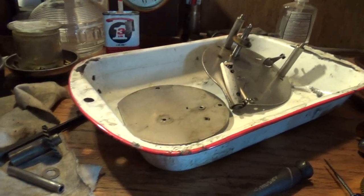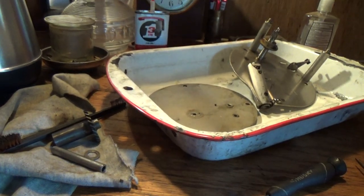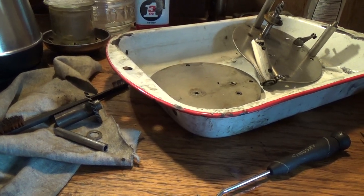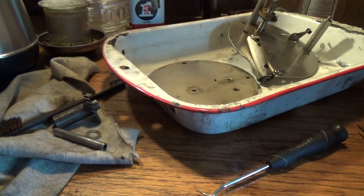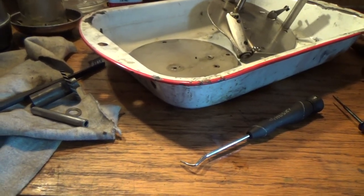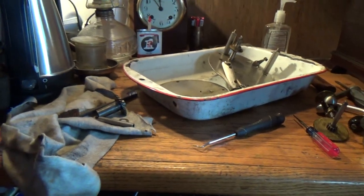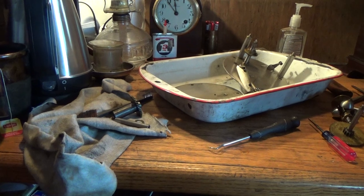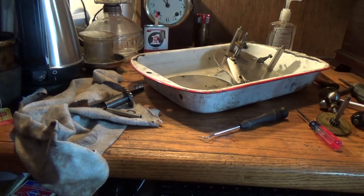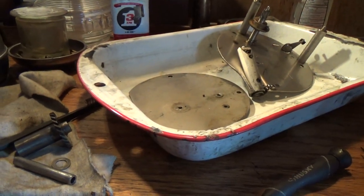I am working on a 410 motor again, from another HMV 101. This machine was one that I bought from another collector some years ago. The collector had somebody install a new mainspring in it — common enough; I generally do this myself. Whoever did it did put the mainspring in, and it appears to be functional. They actually used the old-fashioned formula, which is black graphite with Vaseline by the look of it, which is fine. Nothing wrong with that — it works just as good as anything else, as long as it's lubricated and you don't overdo it. But that's where the good news ended.